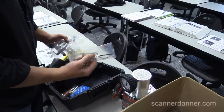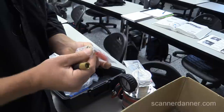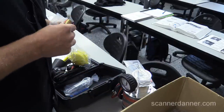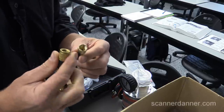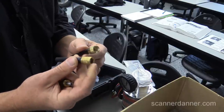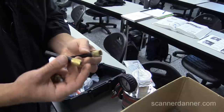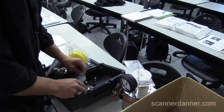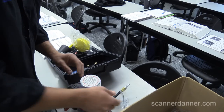There's the hook and stuff for the top, and it comes with a Schrader valve tool and a valve. I don't really like this design compared to my other one. On the inside for the service port, there's no Schrader depressor like my other one has — this one will depress the Schrader valve, this one has nothing inside. You get better flow when you remove the core, so I understand the difference, but I'll still use my old one.